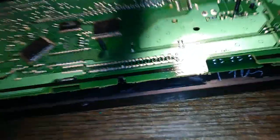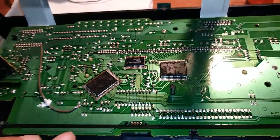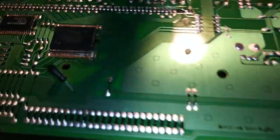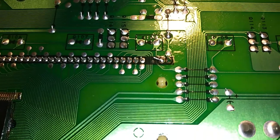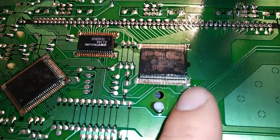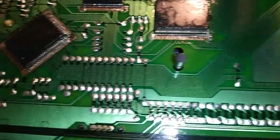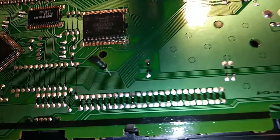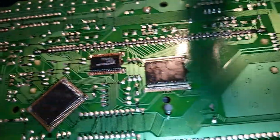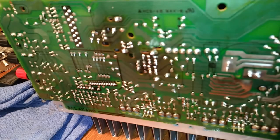I think we've got some more progress here. There were a couple of cracked solder joints on the screen display board - these two pins looked suspect so those got reflowed; all the rest look good. I also found a small solder bridge from when I reflowed these before, so that might have been an issue as well. I removed that solder bridge and reflowed those two, so if there are any issues related to that on this board, that should now be resolved. I also reflowed all the joints that looked suspect on this other area.